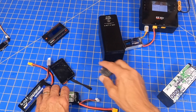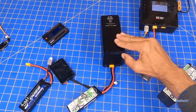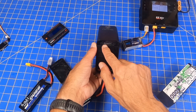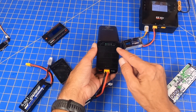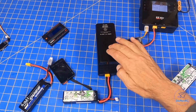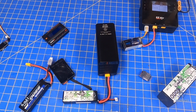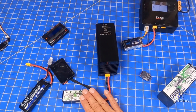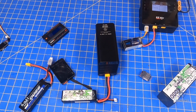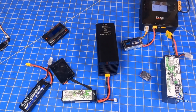The other way I go about it is with this system. It allows me to turn it on, set up how many cells, the discharge rate — let's say five amps — and I just let it sit there and it goes. With this system it's super handy because I can discharge batteries from the field that I didn't fly due to weather or whatever reason, and get those discharged down in minutes versus the charger method, which is going to take an hour or so to discharge batteries — especially a big 6,000 milliamp battery.